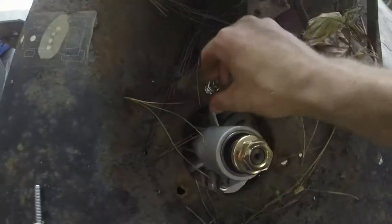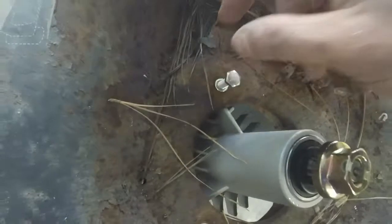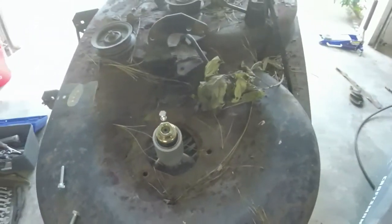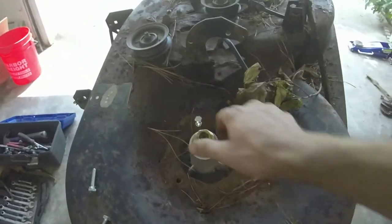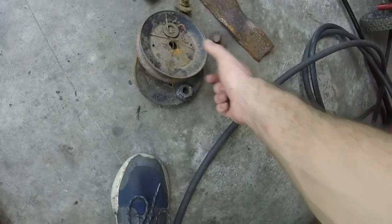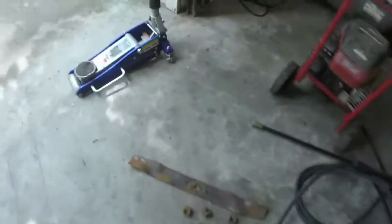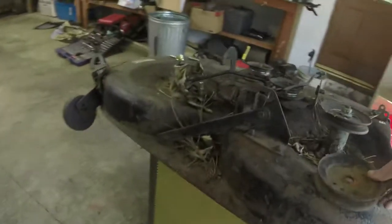Before I do the others I want to mention: with these aftermarket spindles, I like putting washers around the bolts because the lock nuts and heads aren't very big. So I'm going to put washers on — I'll show you the finished product. All you have to do after you put the spindle on is put your lock washer on, then put this piece on and you're good to go. I'll do all that and show you the finished product after I turn the deck around.